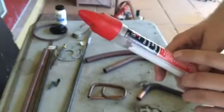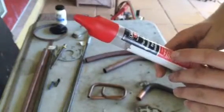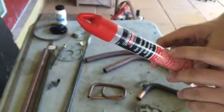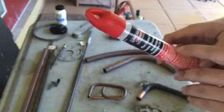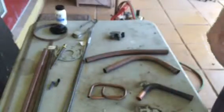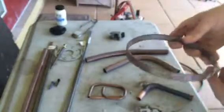On the label it states the HNF flux-coated bronze is a general purpose copper-based brazing alloy rod used extensively for gas brazing steel, other copper alloys, cast iron, nickel alloys, and stainless steel. On the internet it also mentions you can braze brass. I mainly use it for steel when I'm out in the field — maybe I have to make an L bracket or something like this here.